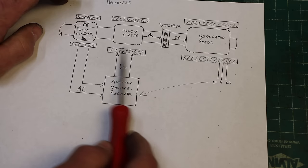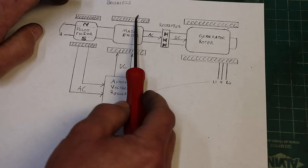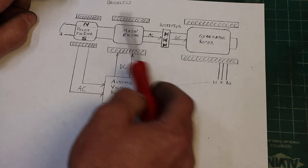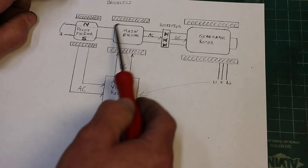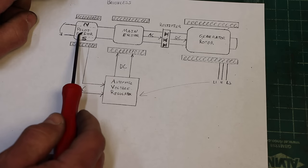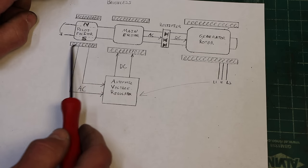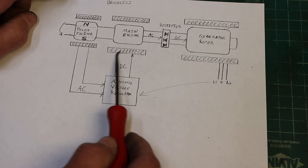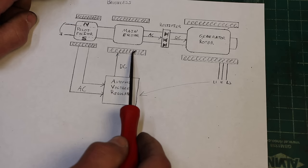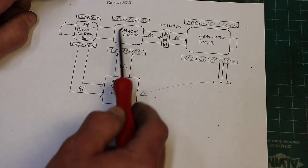We have now a third section on our stator. We run the DC now through the static portion, the stator portion of the coil. The DC current running through here creates a magnetic field, and now we produce alternating current on the rotor coil. So we're just doing the opposite of what we're doing here. Here we're rotating a magnet on the inside, making alternating current on the outside. Now we're running DC power, creating a magnet, on the outside, creating alternating current on the inside.